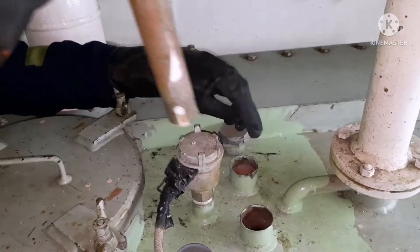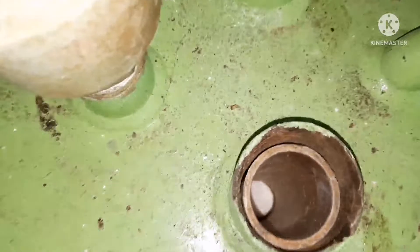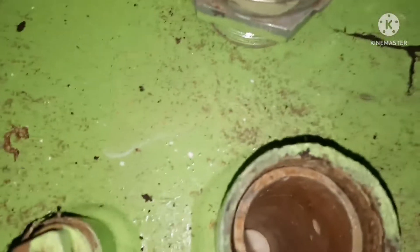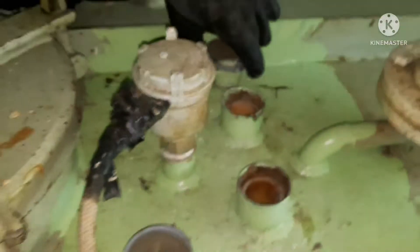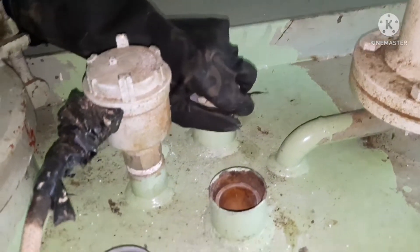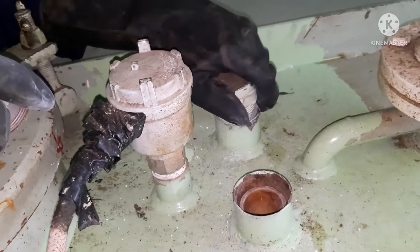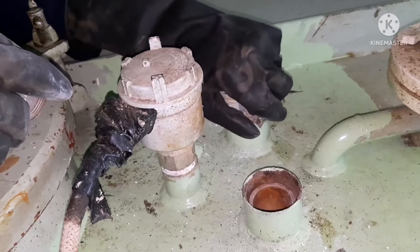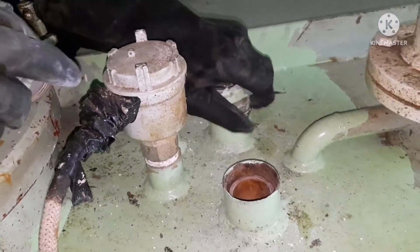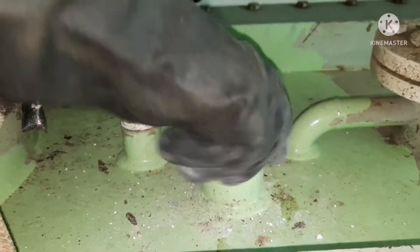Insert through the pipe and close it with the cover. You can see the tablet is visible. When you see the tablet visible, that means it is okay. When PSC comes on board or during a general inspection, just open the cover and look for the tablets. If the tablets are already dissolved in the water, you need to add more.